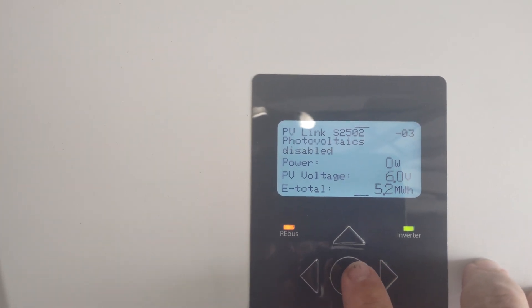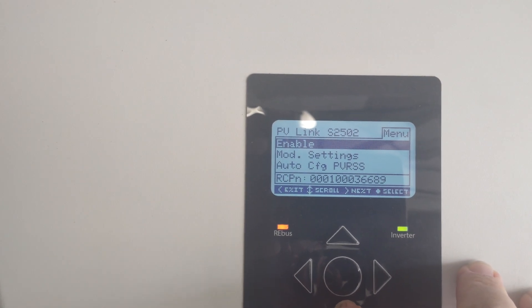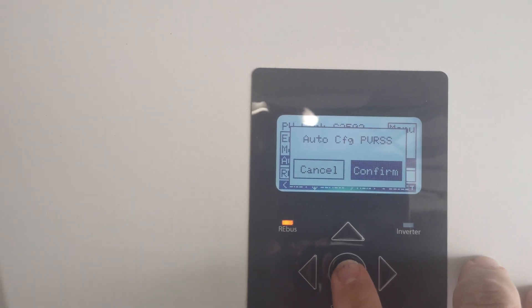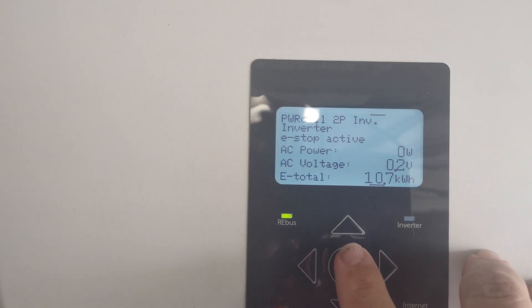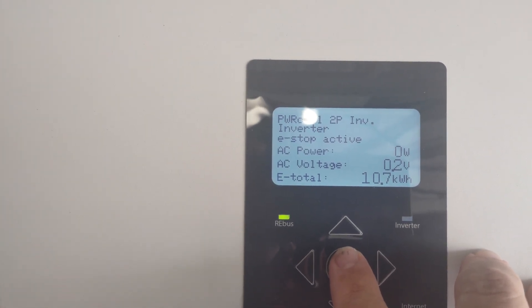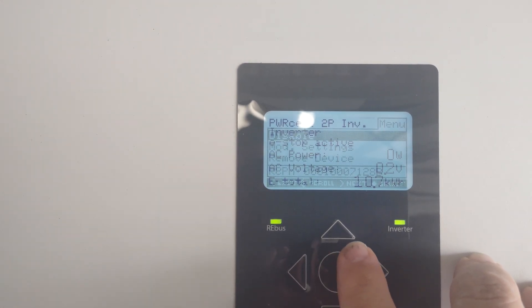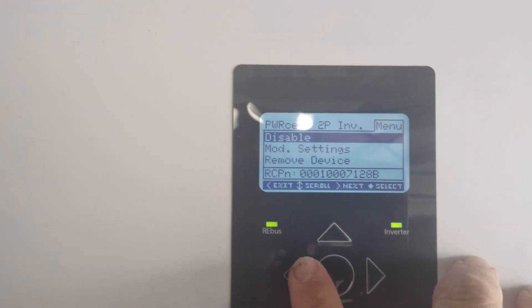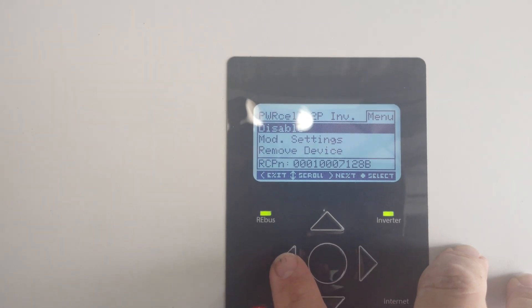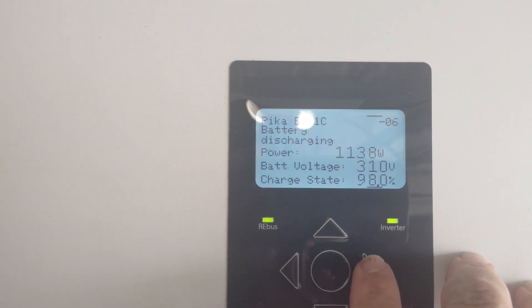We're going to go to the next one and hit it now. These are all a little tricky because you don't really see them changing. We're going to go ahead and hit the center button, arrow over, confirm, and enable. Then go to the next one. We can see our Rebus lights coming on and our inverter starting to blink — that means it's starting to produce power. We'll hit our enable button here. If we get into an area where we've already been, go ahead and hit the back button to get out and that will allow you to get there.